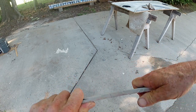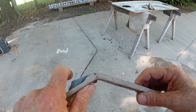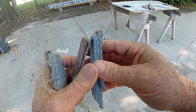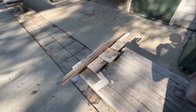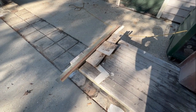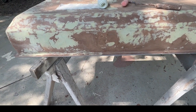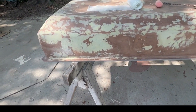I was playing with my little cutoffs seeing how strong they are — they're pretty flexible and pretty tough. It's hard to tell what breaks first, but I've got to believe it's the brown laminates. No problem with the strength testing. I confirmed the bond between the brown paint that I painted the inside of the mold with and the first layer of glass was pretty sad — I was pretty confident that was going to happen.